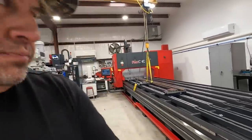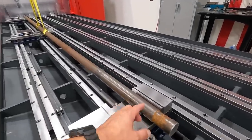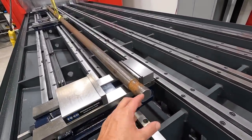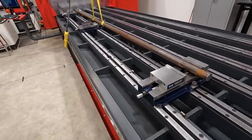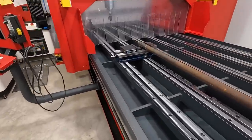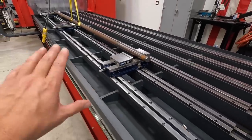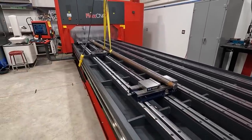I have a shaft in there right now - this is the same size shaft that we're going to be machining. This is one I did in the past that you may have seen in a previous video. I cut a few inches off it because the one we're making is slightly different - the keyways are a little different and the end length was about four inches different. So I'm using this as a test piece. I've got three TECO vices set up and I have them all indicated in line, straight and parallel with each other. I have a video clip where you can see me sweeping all three vices - they should all be within about half a thousandth of each other.